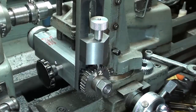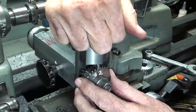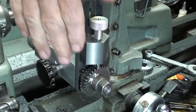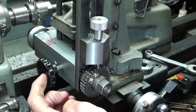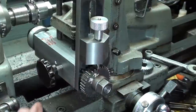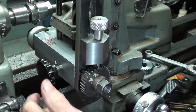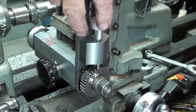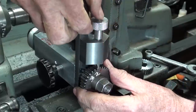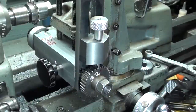Let me show you this now because it might not show up during actual cutting. I'll lift up the plunger and start on the red dot — just a good starting spot. Always tighten up the lock. I made fun of this big, bodacious, black, ugly knob earlier, but now I love it — it's just the right size to give you the pressure you need. Make sure you lock that for each tooth that you cut. After cutting tooth number one, I would lift this up and very carefully put it in the number two pocket, and so on for 30 more times.